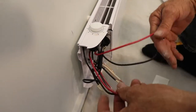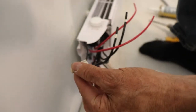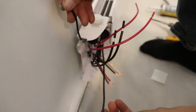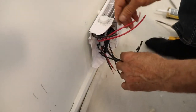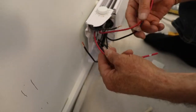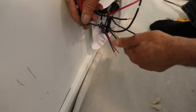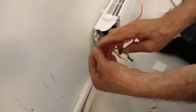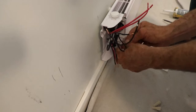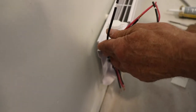As far as the wires go, we just disconnect this wire here — this one we just gonna disconnect. We have two open ends right there, and we have four wires from the thermostat. We're just gonna grab these two here and connect to the feed wires. We have here the ground wire — let's connect the ground wire to the screw right back there. You see that screw there on the head.